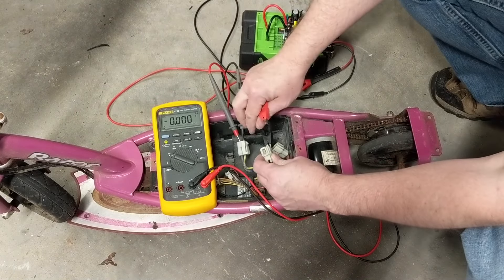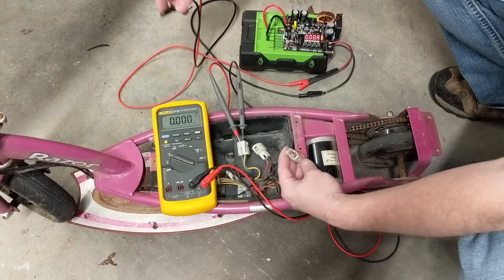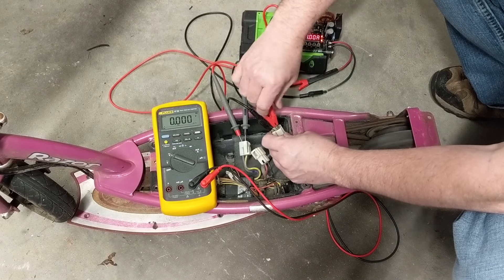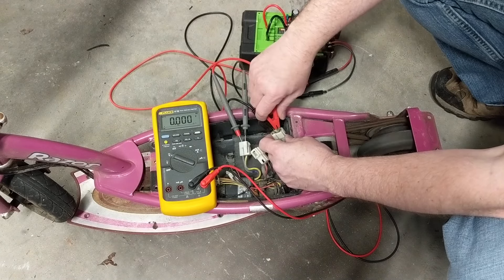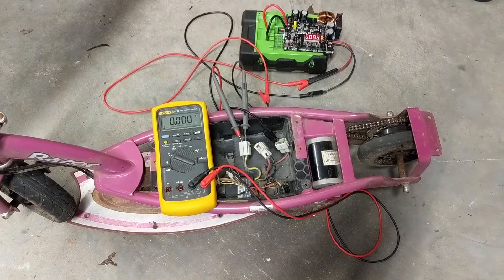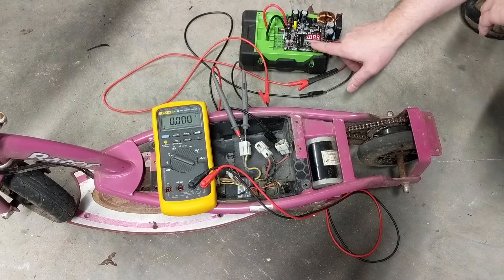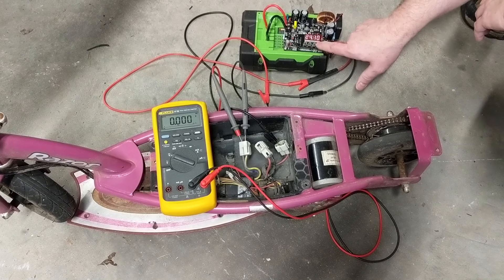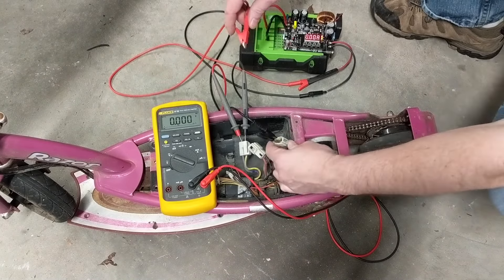What we can do is be careful and take our 24 volts, go to our amp readout, and go straight across the motor with our buck regulator power supply. That was extremely weak, but I did have a limit on the current to one amp so it limited the current. I'm going to go up to around three amps and we'll watch the current — it should take off a lot faster.